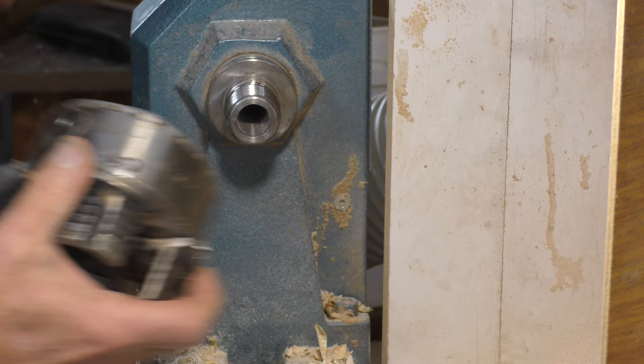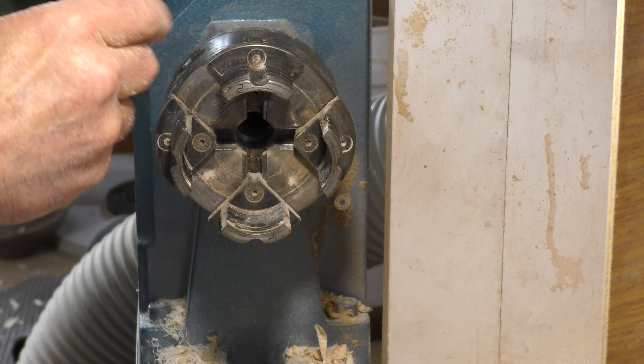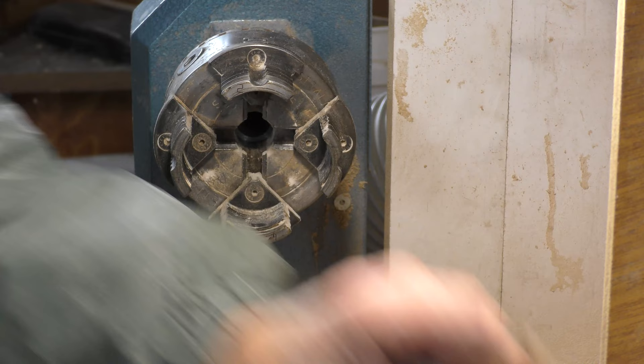That's why you have catches - rather like the pressure on a gouge. So when the chuck goes on, just at the last minute give it a little kind of flick on. That means if you sand in reverse later, the chuck's less likely to come off.